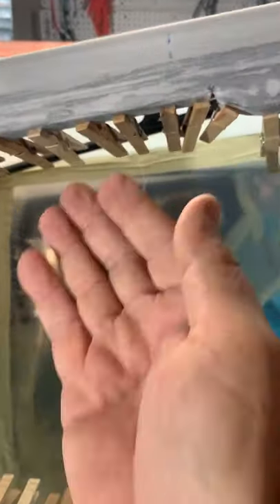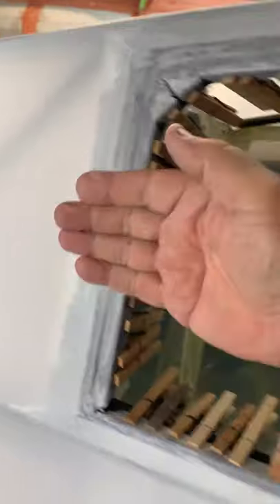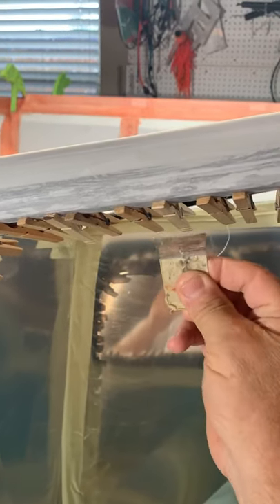Once you've got the iron where it's laying over, pull it up, put glue on the carbon fiber flat area, lay the fabric over, and get it down good. The last thing is we're going to have to go back and tuck it on the inside, wrap it around this piece on the inside just like we did with the windows. Once this is dry, take your iron and iron all the fabric all the way around where it's pointing back up towards the outside of the baggage area. Then pull it down, measure the fabric, trim it, put glue just on the fabric in a small section, tuck it on the backside, and smooth it out. Take a small tool to push it down in there and get it laid down smooth.